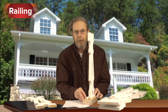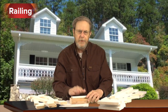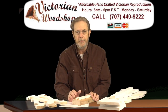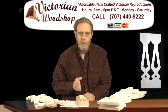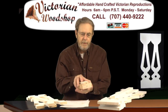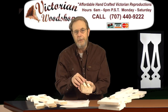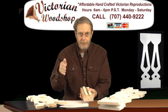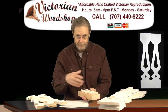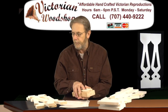You can even paint them different colors. The reason for this kind of system is it avoids having to come up with a very expensive railing system, or having to route a three-quarter inch groove in a piece of wood — both very difficult. Also, the three-dimensional effect of having the cove molding on top of the wood means it doesn't look like a two-by-four anymore; it looks molded and coved. It's a really nice, inexpensive system, and you can do an entire railing system on your porch for $50 to $100. It really cuts the cost down.